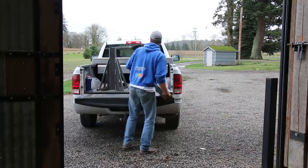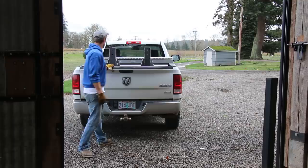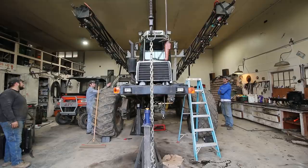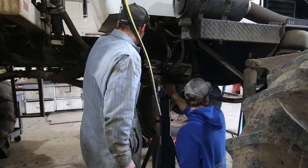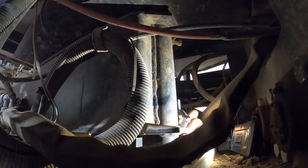The jack stands weren't quite done, but they were usable and the guys were waiting on me up at the farm shop. More than just changing the tires, the job that really pushed us to get these jack stands made is we're needing to replace the two-inch-wide main pin that the whole sprayer articulates and steers on. We'll probably put it off a little longer than we should have — you can feel some play in it driving through the field.